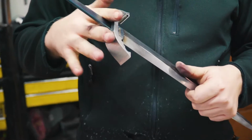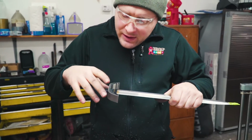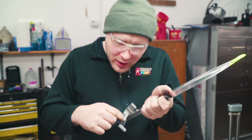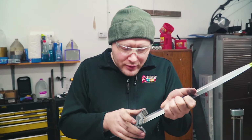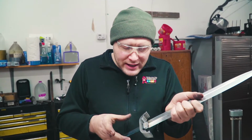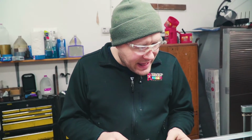The next thing I want to do is hammer this on here and then start the process of gently removing a little bit more material until it fits up there nice and tight. And then I'll go in and eventually the Ricasso will leave a mark on the blade. And I mill about a 1/10 of an inch relief so it goes up over the Ricasso, and take it in on my engraving stuff and get it so it's actually inlaid. The Ricasso will be inlaid into the guard. Yeah, that's ready to start being hammered on there.